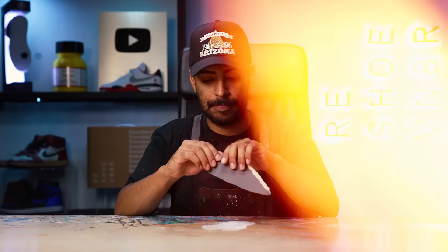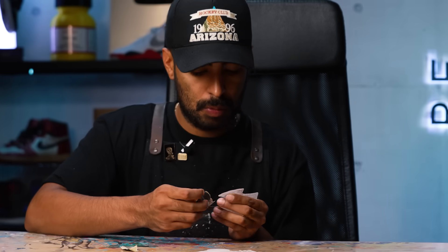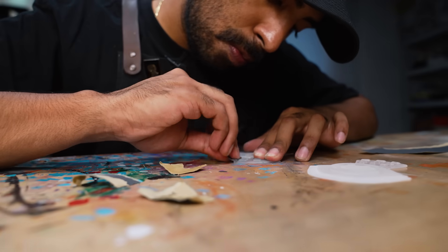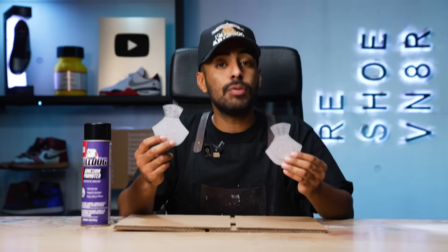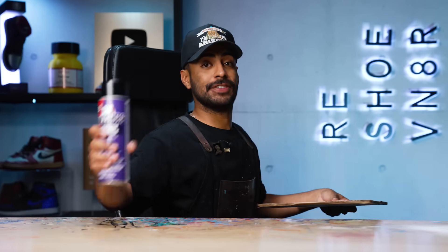Prep is complete on the back side. Now we're on to the front side, getting ready for the paint job. First, we're going to use some 400 grit sandpaper and go over the entire front side for prep. Then we're going to go outside and spray some Bulldog adhesion promoter — this is going to help the paint stick a lot better on the front side and the glue on the back side.